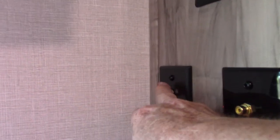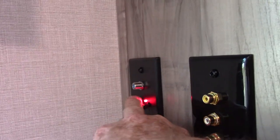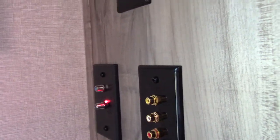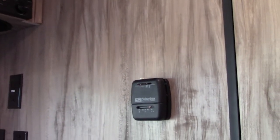There's a backer plate here if you'd like. This is a signal booster for the digital antenna — you can shut it off, but you'd want it on. You hook your TV coax right up to here, and there are obviously patches for sound and video. If you get a swing-out or scissor bracket, try to spend the extra money and get one that locks into place so you won't have to hang straps to keep the TV from flipping around when you're traveling.